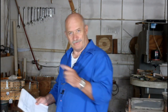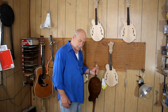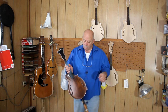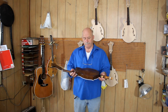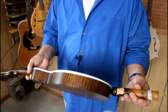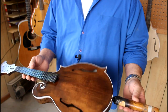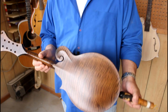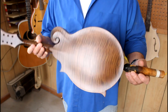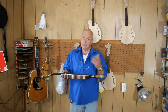Let me show you mandolin number six right now. Here it is — mandolin number six. By the end of Wednesday I had everything all cleaned off, the logo applied, and three build coats shot on top of it. When Thursday came, I sat down with some really fine sandpaper and just went over the entire thing, sanded it flat, made it nice and level and pretty, and shot the satin coat to finish it up with. So we are done with this — it's going to hang here and cure for a while, and then we're going to put the hardware and the strings on it.